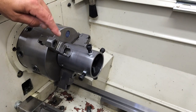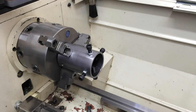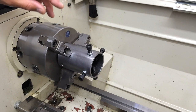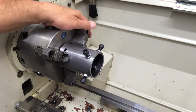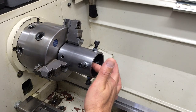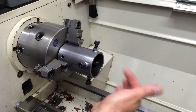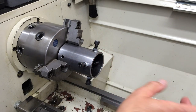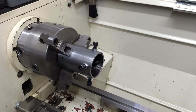In this segment I wanted to talk about the inboard spider project, which I never even finished yet. A friend had a Mosin Nagant that needed the barrel cut down and threaded to 5/8-24, and I thought - great, perfect opportunity to use the inboard spider. The Mosin Nagant has an odd shaped receiver and it's a bolt action rifle. I didn't film it because my buddy's camera shy and didn't want his rifle on video, which I understand. I chucked up the receiver in the spider using the four ball adjusting bolts, then used the tailstock to support the end of the barrel where I did my cutting, threading, and crowning.